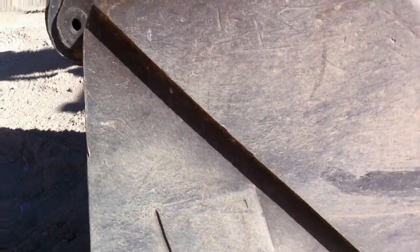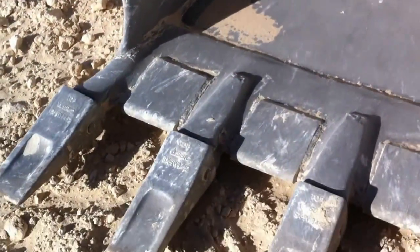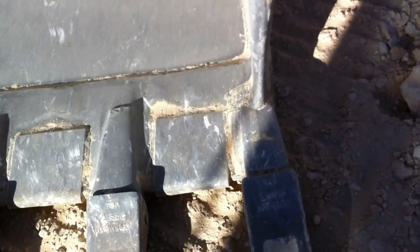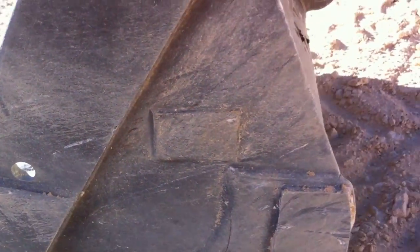There's something a bit strange going on with the bucket — it's on both sides. Looking inside, there's no evidence of anything serious happening there. Checking all the teeth to make sure they're all in place — nothing missing, no chips or cracks. There's another one here that's obviously just a wear-and-tear scenario, but I will report that in my pre-start.